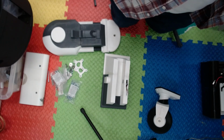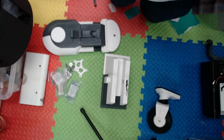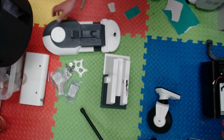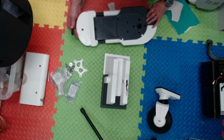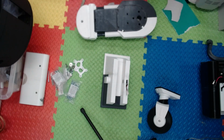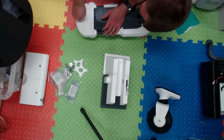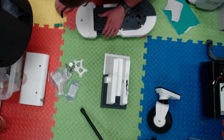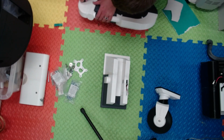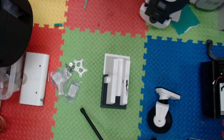And essentially it's repeating the process for the other leg. Just move the hose out of the way. So again, it's just repeating the same process, just sanding it until it's smooth. Yeah, in this case it's definitely sanding. I wouldn't spray putty it to get it smooth, because you're making it thicker. You need it thinner at this point. And I think the additional walls help in that case, because you can confidently sand away the material and know there's still some wall material left.